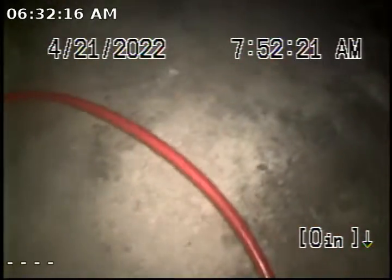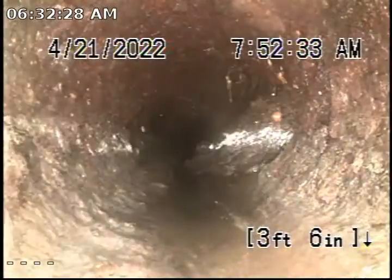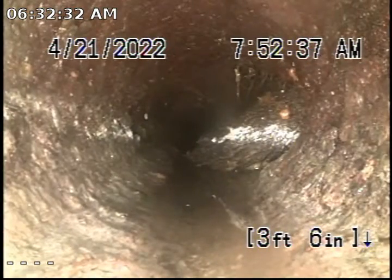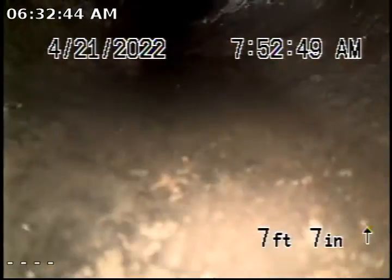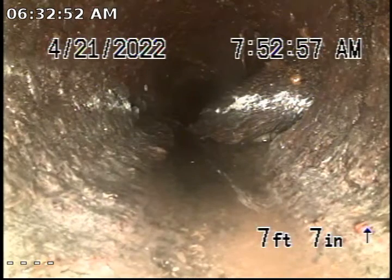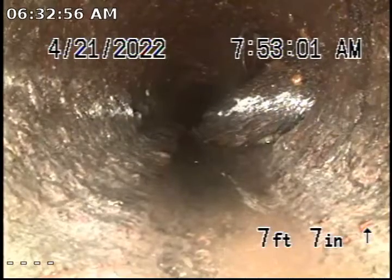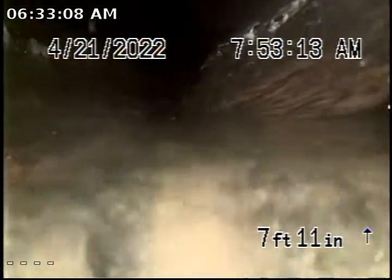6933 Metropolitan Street, scoping from a basement clean-out in the basement utility. It starts off with cast iron, and right there we have a hole in the side of the line with root intrusion — literally the bottom of the stack right there. Roots coming through all the side of the cast, literally just six to eight inches past the bottom of the stack.